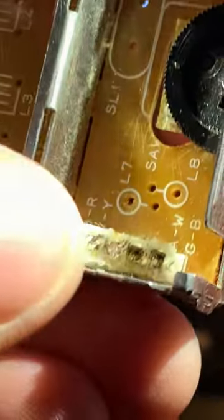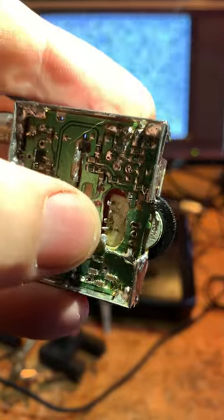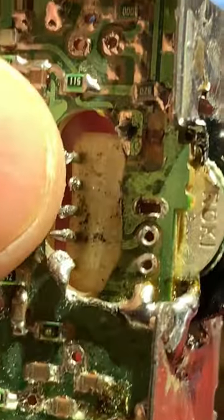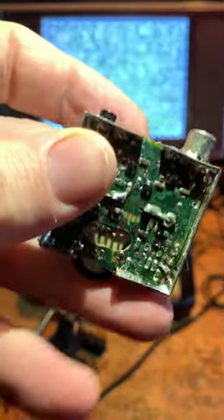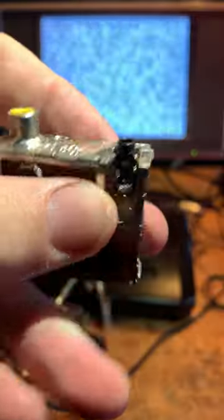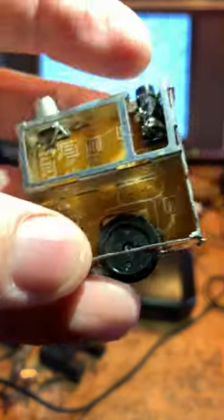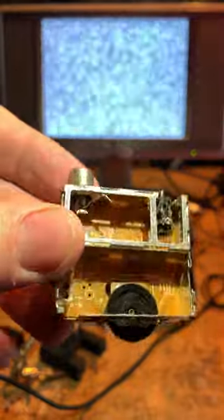All the wires are out, but the wires came in here and I tapped into the signal in the back, then soldered them to this volume wheel potentiometer. I had the incoming left and right, and then the outgoing wires going up to this headphone jack so I could wear headphones while playing games on the Mega Drive and control the volume. The video signal I wired over, took out the coax connection, and soldered in a yellow video connection. This worked great for a while, but it has since broke.